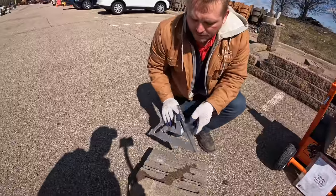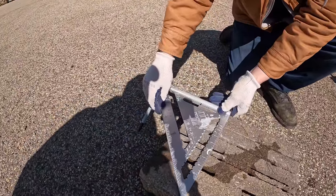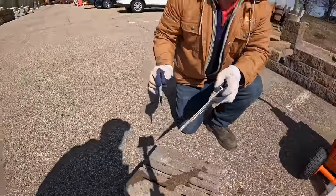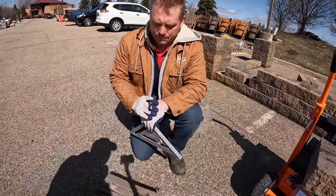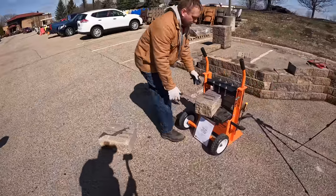On the following course, you do the exact opposite — flip the framing square to the other side, mark at the four-inch mark, and saw-cut back on that side. That ensures each face is the same going up whether it's the right side or the left side. Let's do it and put it together so these guys can see it in action.